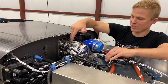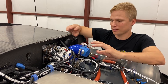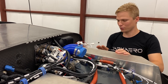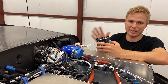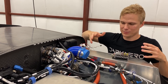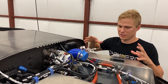Going around here, this connector is what I'm calling the miscellaneous everything-else connector for the wiring into the engine, with the other two connectors being ECU1 and ECU2. There are a few things I have to tidy up here, including adding shrink sleeve boots to each of these. I'm also going to be adding a fuse holder to the side of our air cooling box. This fuse holder and fuses are for all of the flight-critical hardware like our ECUs and landing gear, and that will run separately through this loom. Some of the other remaining items are adding the air intake duct and a few other things, but for the most part the wiring is wrapped up here in the engine bay.